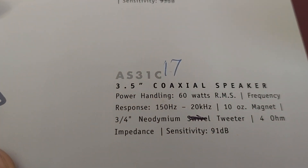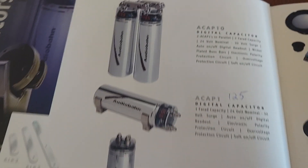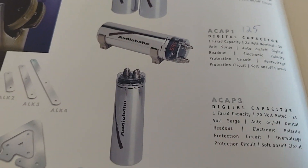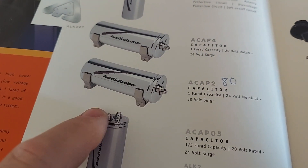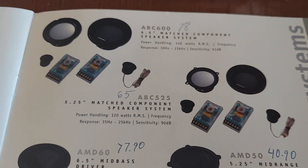What does it go down to? 150 Hertz — so you'd cross it up at 300 Hertz, one octave up. Very nice capacitors. These look familiar, like the Fusion stuff that we saw — same bars. I don't think it was called Edge back then because this is right during the time of the Lightning Audio era.